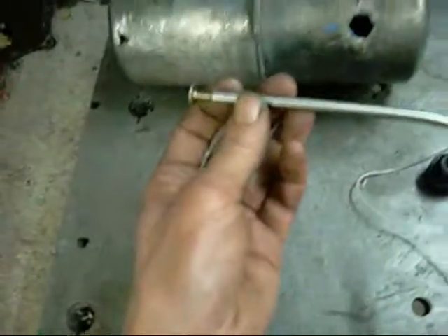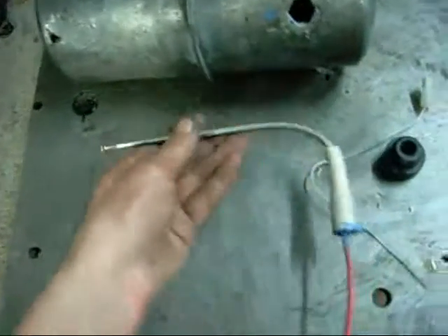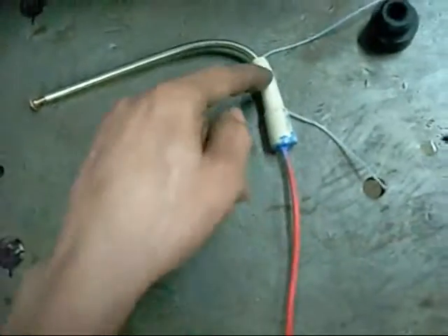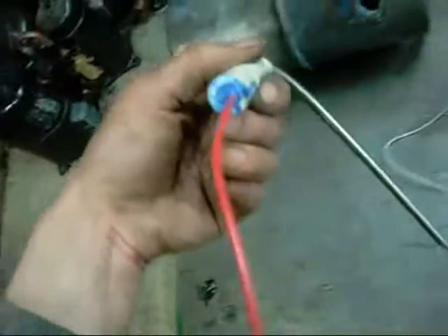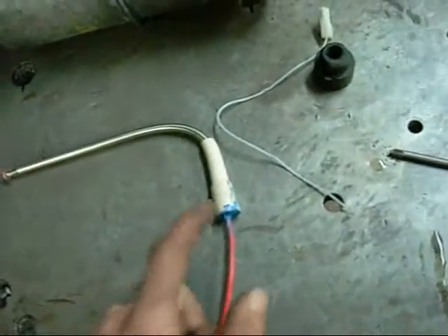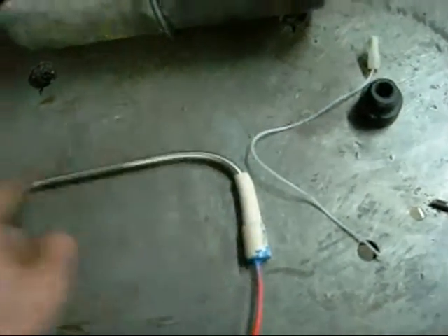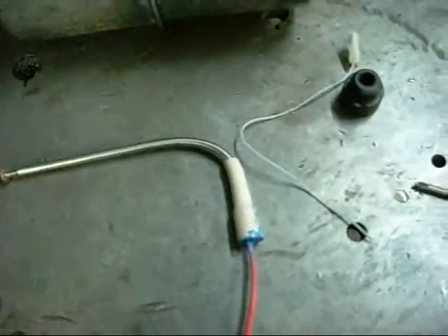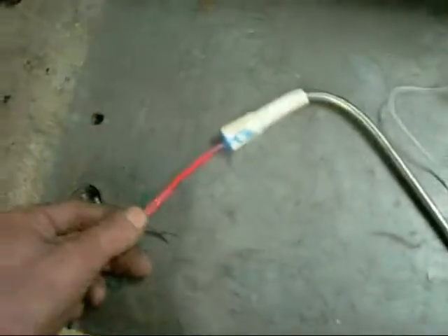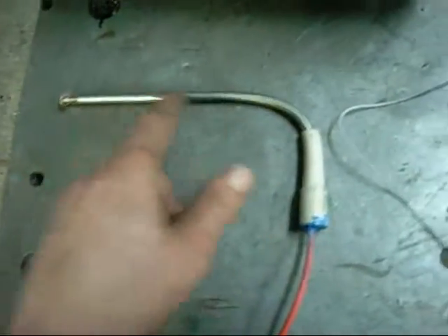What I've done here is I've taken a piece of steel bar — well, it's actually hollow tubing from an old printer, bright steel — and soldered an anode lead, just a piece of copper wire, into the inside of it and bushed it off with a rubber bush and a bit of silicon. Now electrolysis attacks soft metals very quickly. The copper lead and the solder joining it to the steel would degrade long before any of this de-rusting is done, and it would break the circuit and probably short out against the inside, or the anode would collapse inside. So I pushed it off with a rubber old spark plug lead bush and a bit of silicon. So as long as you protect that connection — that lead solder connection — all that's going to be rusting is this sacrificial anode.